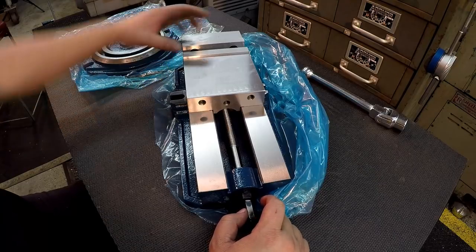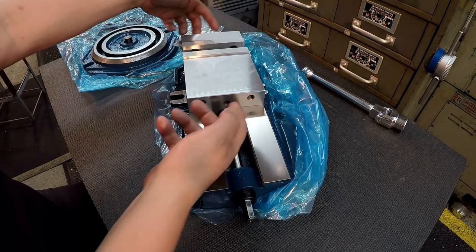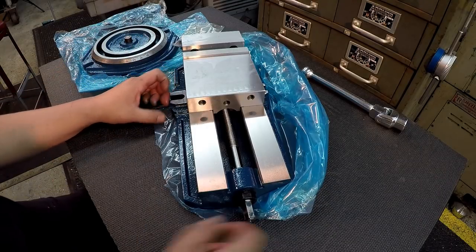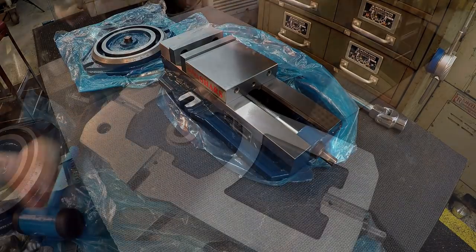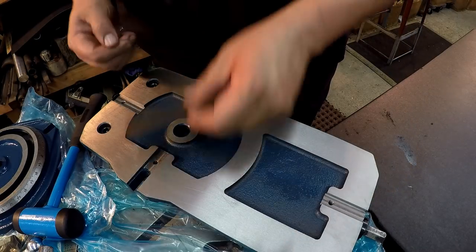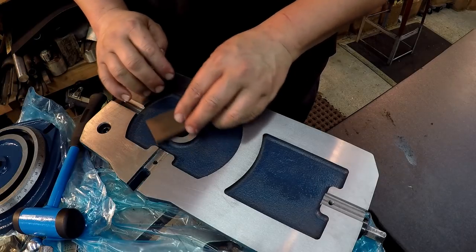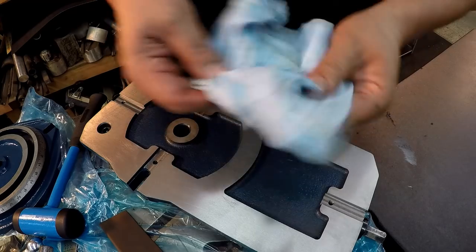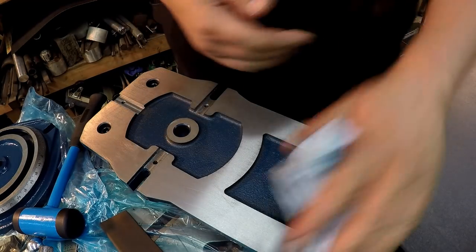This vise is supposed to open up five inches with a five-inch capacity. On the outside you can move the jaws to the outside, just like a Kurt-style vise, and put your part on top with a twelve and a half inch capacity. I flipped it over to take the keys out and felt like there was a very slight burr on those keys, so I took my stone and just very lightly rubbed over those to remove any burr. Got the granite plate cleaned off using my Standridge cleaner.